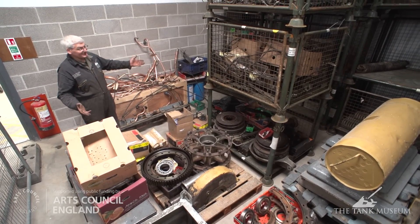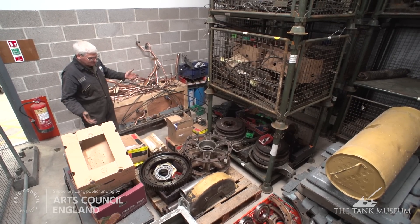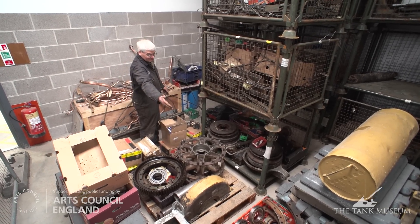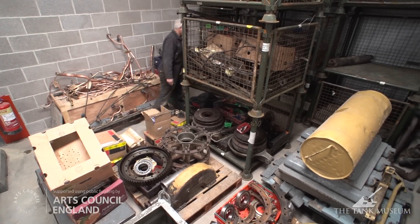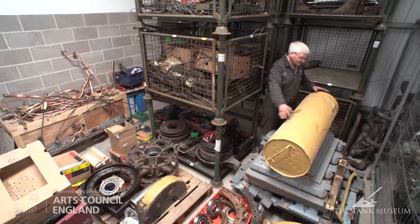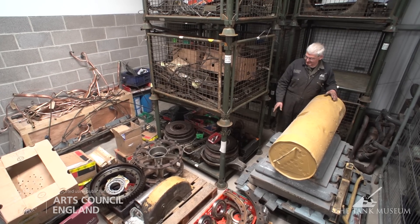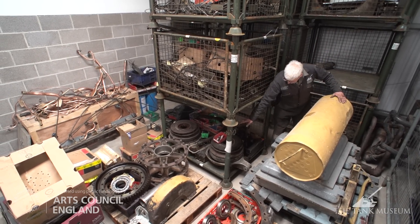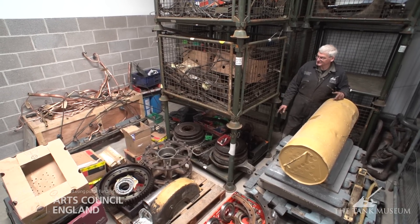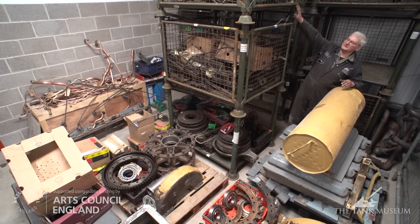As you can see, when you take a Matilda apart — or any tank for that matter — you end up with a lot of components, and this is our component store from the vehicle we've dismantled. On the stillage here we have one of the final drive assemblies; next door to it is the second final drive. Over here we have a stack of parts — these are the engine and gearbox decking assemblies, and the large tank assembly is the auxiliary fuel tank off the rear of the vehicle. We would never run the vehicle off that but we do want it for completeness. The lower stillage has clutch and cross drive components. The cross drive is the mechanism that joins the two power plants together — the Matilda is driven by two engines driving on a common gearbox. This stillage also has controls, some of the air system, and the electrical system in the top stillage.